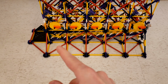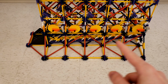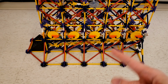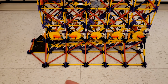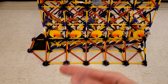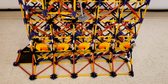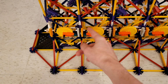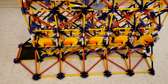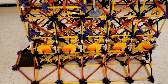So what I've done is, if you recall from the first main video, there used to be 5 little slots out here for the 5-bit number, which is the answer, or the thing this actually calculates. And it was either a ball for a 1 or no ball for a 0. But now we have these 5 dials to represent the 5-bit number. So here you have left for 1 and right for 0, just like up at the top with the input, except this time you're reading it rather than setting the dials yourself for input.